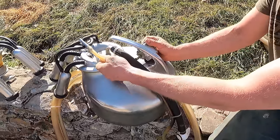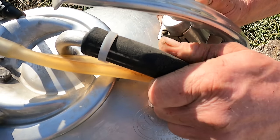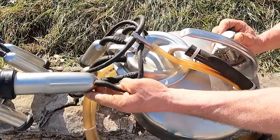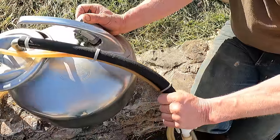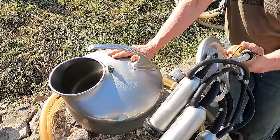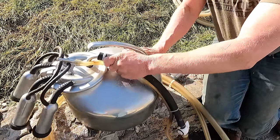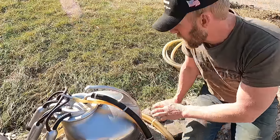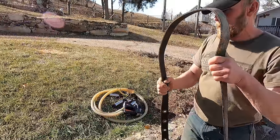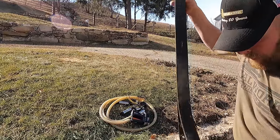This is what they call double pulsation — you got two hoses. This small hose is your pulsation hose and then your main air hose. Right now this is set up so that when she milks, all her milk would go into this container with vacuum inside. Then you could take your lid off, and this one would hold probably about 60 pounds. They made smaller ones too for like the Jerseys because she's lower to the ground and didn't give as much milk. You had this strap and you'd put that strap on her back.